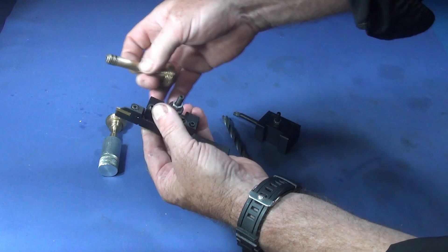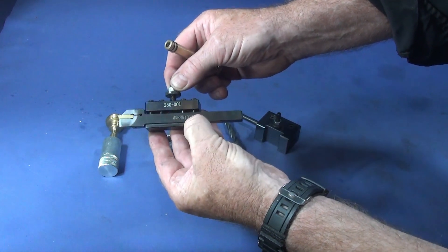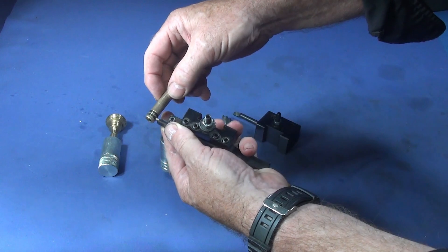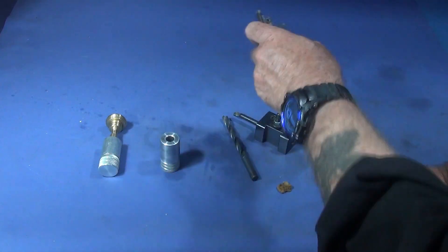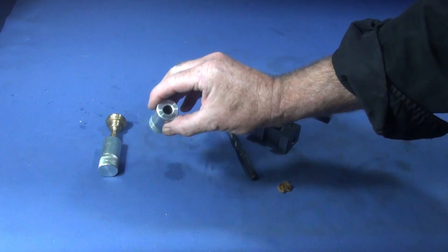To make the o-ring grooves I use these tools here which I get from Banggood — it's the MGE HR 1010 1.5, so it's a 1.5 millimeter thick groove tool, which is ideal for the size of o-rings I use. I also use these for parting off, so I'll put a link below for those.